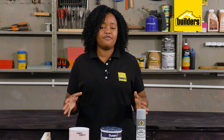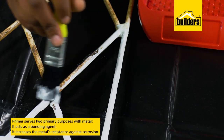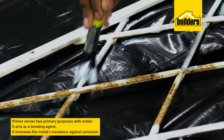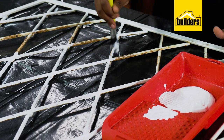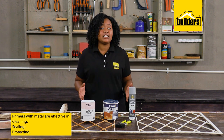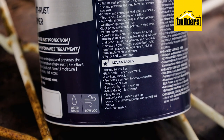When painting metals, especially ferrous metals, which are more prone to rusting because of their iron content, primer is a must. Primer serves two primary purposes when it comes to metal. First, it acts as a bonding agent that allows the paint to better adhere to the metal. This anti-rust metal primer also gives the paint an extra boost of durability, as primer's second responsibility is increasing the metal's resistance against corrosion. Primers contain several components that are effective in cleaning, sealing, and protecting metal, making it more resistant to corrosion-causing agents in the environment such as rain, humidity, and salt.